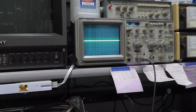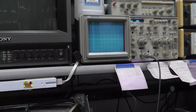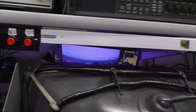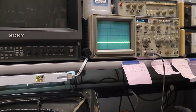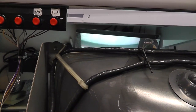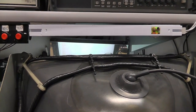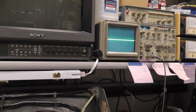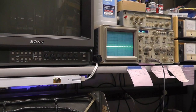As I decrease the resistance to ground, letting more voltage go to ground, my screen gets brighter. As you can see, I have a little mirror there. My voltage decreases all the way to about half a volt, and I have a completely white screen. And the monitor's screaming a little bit. It doesn't really like being in that position. But you can see I'm adjusting that voltage going to the amplifier of the color signals.